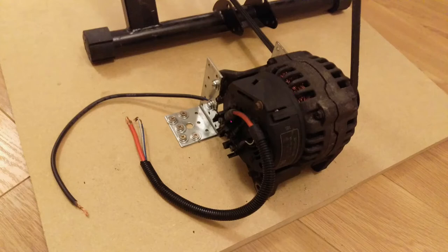That's the next phase: you can see the alternator bolted in on the brackets and the stand on there. I've taken the magnetic training apparatus off — do make sure you get one that you can take off, because you don't want one that's welded on. The friction interface is much less efficient than a drive belt, so a drive belt is definitely the way to go. Also make sure you've got enough clearance for the belt to clear that beam at the bottom, because rubbing on it generates friction and heat, makes it harder to pedal, and might cause deformation on the belt over time.